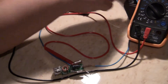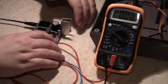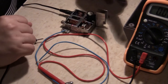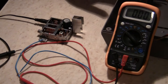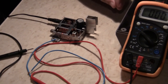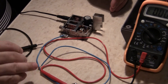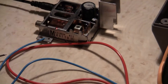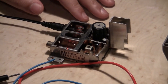Why is this important? There are two reasons. One, I want to keep it aesthetically pleasing — I want it to look exactly like an original, so I don't want to take anything out of it. Two, the hard drive needs power. The Raspberry Pi can do about 2.5 amps, which is enough to run itself, but for an external hard drive it's not enough. So we had to use this to get enough power to run the hard drive and the Pi at the same time without any problem issues. About 9V — that's perfect for what we want. I'm going to put this together, solder it on, and show you how it's soldered. Let's get this power started.